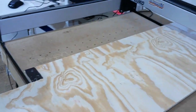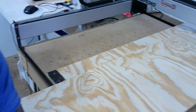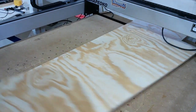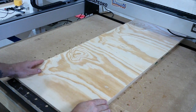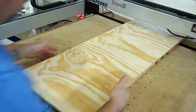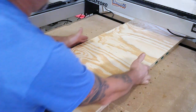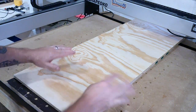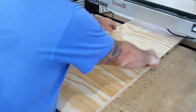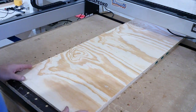What I'm going to do is set that piece on so it runs exactly parallel on top of the piece below. I can run my fingers down through the sides and make sure that it's exactly true. That'll keep that piece from being cattywampus. Then I'm going to drive pins in here, here, and back into here.